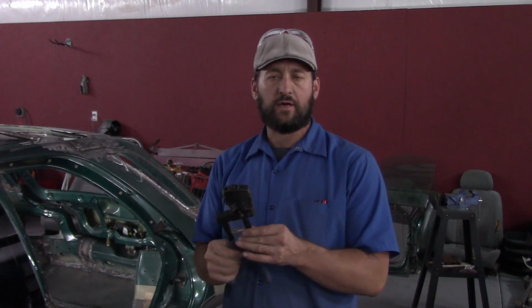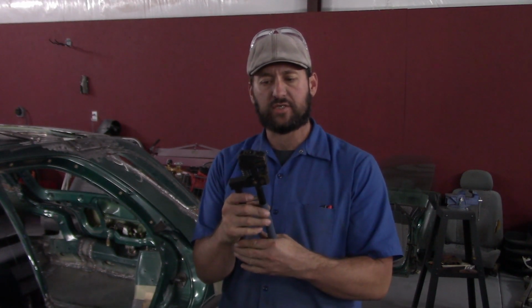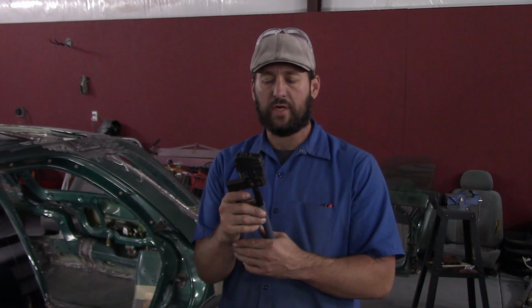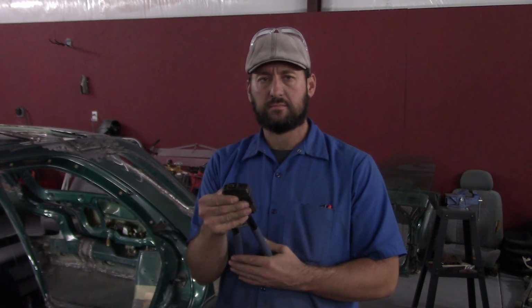To make the roof panel, I'm going to use a tool called a flanger to put a small step in the edge of the panel that will join the two sections of roof together. I do not like to butt weld, especially not sheet metal, because it is not a strong joint. And for something that's exterior, because of the heat of the welding, there will be warping.